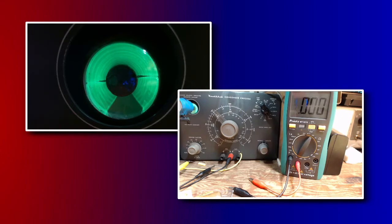I'm learning that a capacitor that has become leaky, probably due to moisture getting into it, a paper wax capacitor that's become leaky, is not going to test properly on the tester here when it comes to its capacitance. And the digital meter is going to be closer. It's going to be maybe 30-40% high.